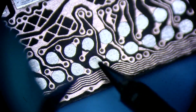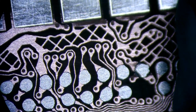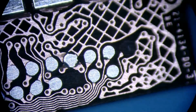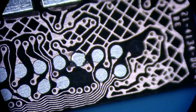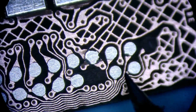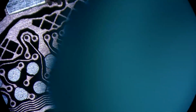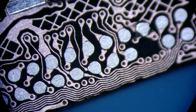But these are the types of things that need to be taken care of the most. For this card, I'm gonna go out on a limb here and say that chip off is not gonna be needed in this case. What we need is to restore all of the point A to point C connections. I'm not gonna worry about point A to point B, because they don't really do much for us, unless we needed to use a quick adapter to make connection with the USB or with the NAND protocol right away.